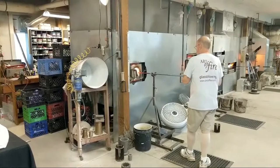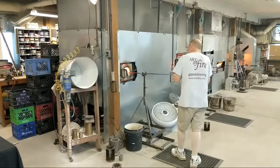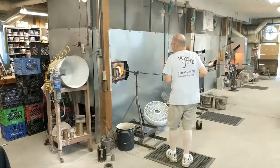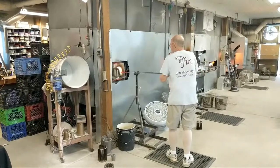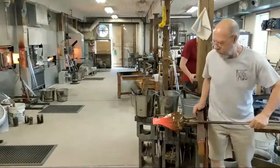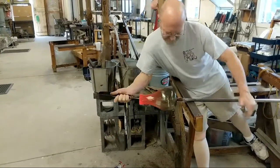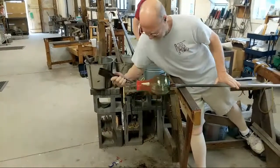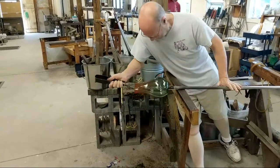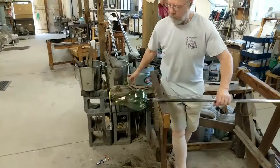He's going to use a pair of shears and trim the glass to give himself a nice even lip on the vessel and also to get rid of a little extra thick glass. He'll use the jack blades for some gentle shaping and then come back for more heats. You can gauge when he's going to go back for heat by looking at the color of the glass. As the neck gets darker, as it loses that orange hue, it'll be getting colder, harder to work, and he'll need to go back for a reheat. By swinging it like that, he elongates it just a little bit.